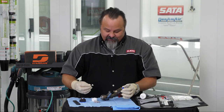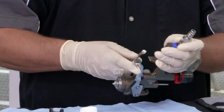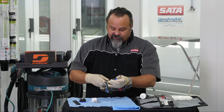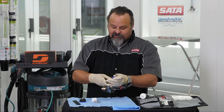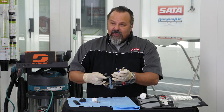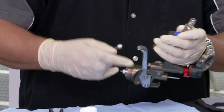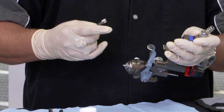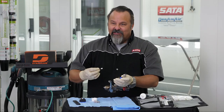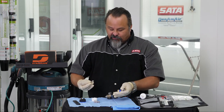The last place I put grease is on that air piston behind the trigger. By putting grease on there, when I pull that trigger, it creates a nice slick surface for the trigger to pull easily. It lubricates the packing on the inside and the air piston packing, and allows no overspray to stick. On the front of each of these packing holders, SATA has made an air piston packing holder with a cutting edge to help remove overspray, which saves on wear and tear on that internal packing.